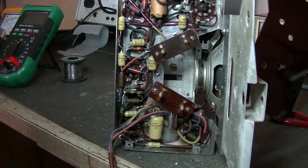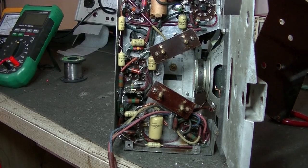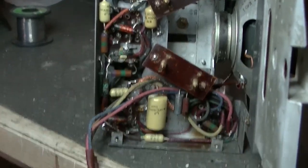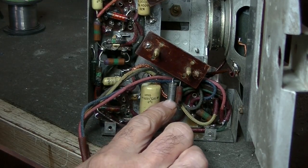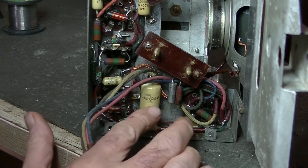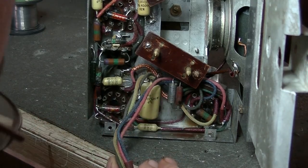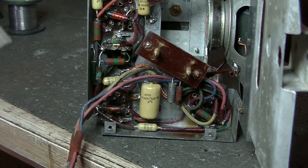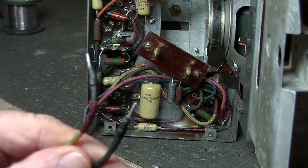They're the original caps and mustards and resistors, and I'm currently looking for at least one electro. And I'm looking at the screen, I think I see it. Yeah, 22 microfarad, whatever voltage, I can't quite read that. Okay, and a 1 microfarad poly, or mustard. So I'm going to work out, again, I just want to be double sure. Hoping that, where are they? These little pins are the filament.